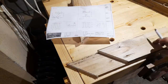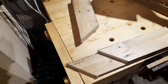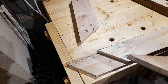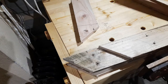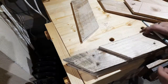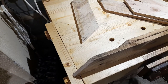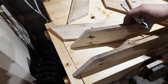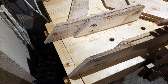First thing is to get all these legs glued up. And it's important to do two sets that don't match. Now, that's not stupid, is it? So, if I did two like that, that's fine. But if I did four like that, these wouldn't match over. So it's very important that as you're gluing them up, you lay them out. Think, right, well, that's the bottom here. Oh, I want that other one to be on my bottom. So it's not lining up, so I need to put that inside like that. So we have matching, you want the gaps on the inside.